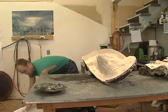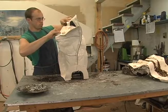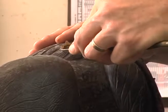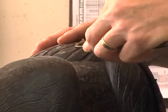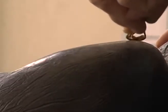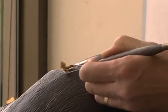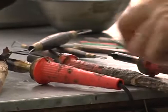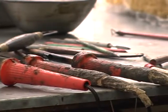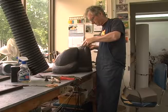When cooled, the mold is opened and a wax replica is removed. Wax chasing is the next stage of the process. This delicate process consists of removing seam lines created where the mold separates, repairing imperfections such as air bubbles, and reattaching any parts that had to be cut off during the molding process. This is done with heated soldering irons and special tools. The completed wax must look exactly like the artist's original sculpture.